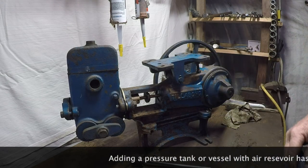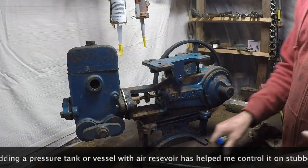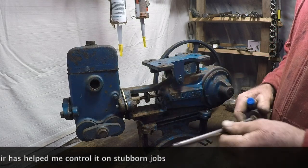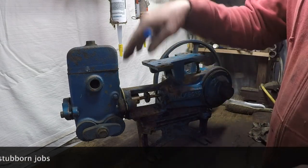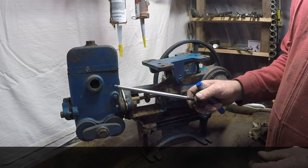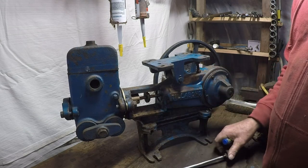Also with the shaking pipes, make sure your two valves have got that little slot cut in them that allows a little bit of water to suck back down. That prevents vacuum lock inside the chamber, which makes the pump run a lot smoother as well — so bear that in mind.